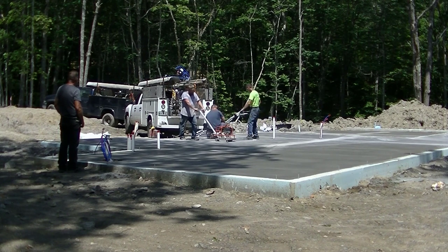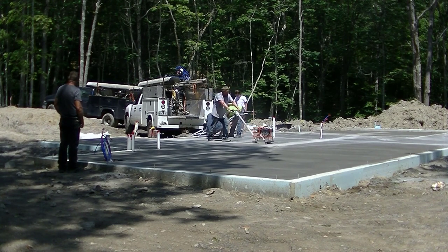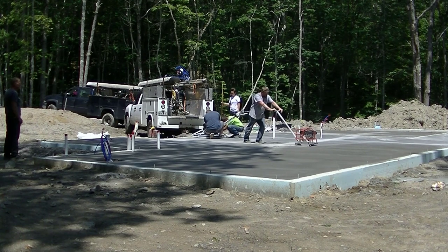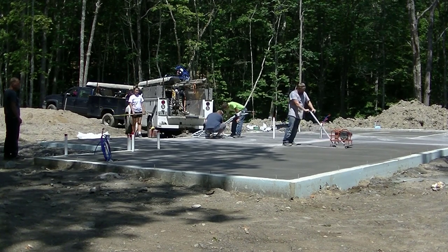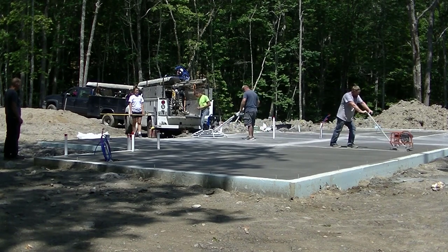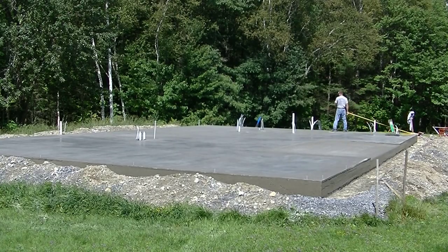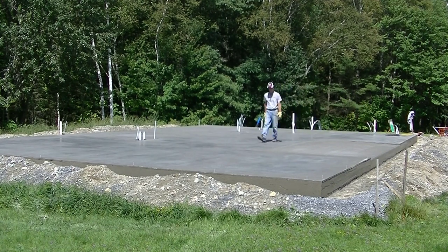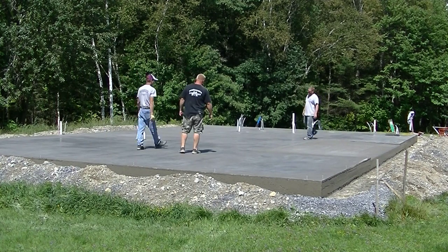You'll come back a day or week later and see where the slab has cracked right in the saw joint. On a house floor like this, the floor is going to be covered with tile or hardwood or something, but it's still important to cut these in to control the cracks - you don't want to lay down tile and then have it crack later. You can see how early we do it; we just got done power troweling that piece there. We shine it out - we call it when we get done the floor is 'shined out.' You could call it 'burnt out' - when the slab has that glassy look or sheen to it.